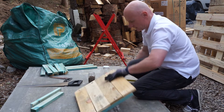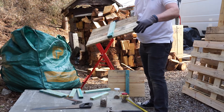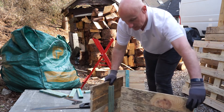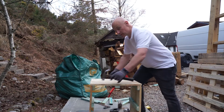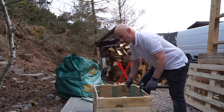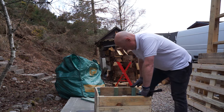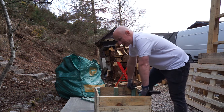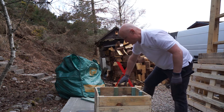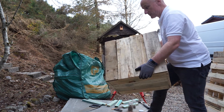That means we won't be hurting ourselves when moving the planter around afterwards. Nice smooth edges and ready for another one. We'll fit them together like so. Now we've got the square, it's time to put the bottom on. It's worth mentioning - keep it all nice and flush. Even though pallet wood varies in thickness, if you make sure the bottoms are flush it'll be really easy to put the bottom panels on. Then we've got the bottom on - time to put the feet on.